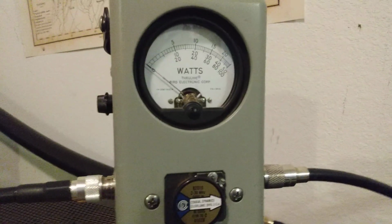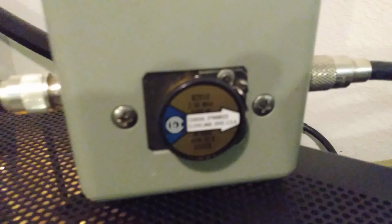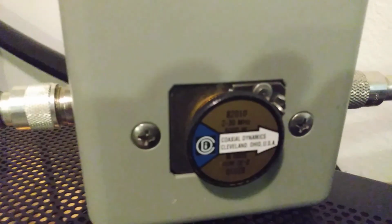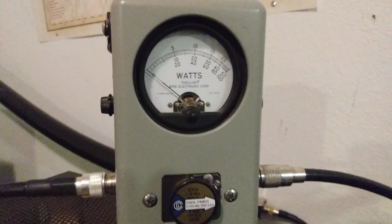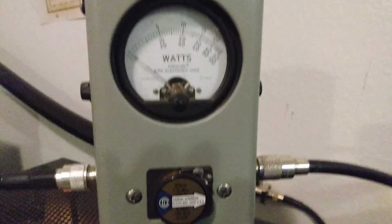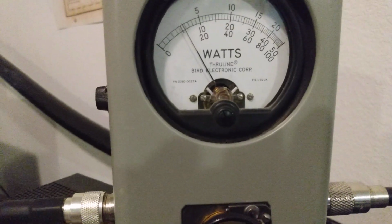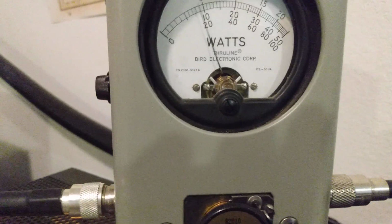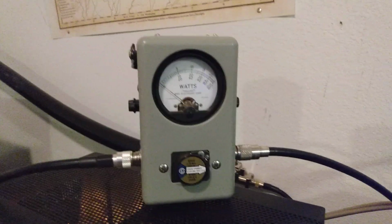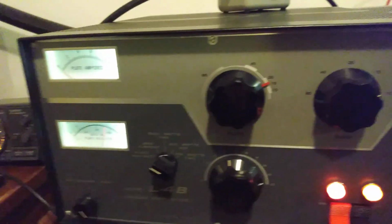All right, that being said, let's show you what this thing does. We're swinging, like I said, around 280, 290 into it. And I don't even know what we're doing average. I would guess 100 watts average or so, give or take. We've got a 5,000 watt slug in there. So we're going to be looking at the middle scale. I'll go ahead and key it up. So that's about a 500 watt dead key. Bouncing up a little bit over 1,000, but realistically right around 1,000 watts average. So that's 500 watts average per tube, not putting it in a bind whatsoever.